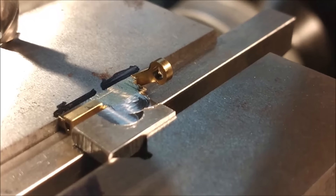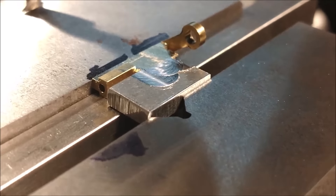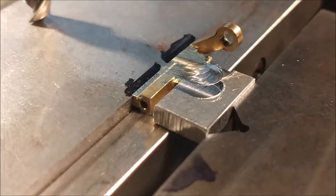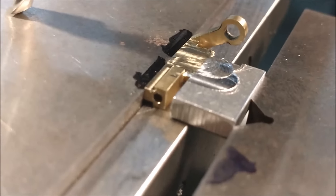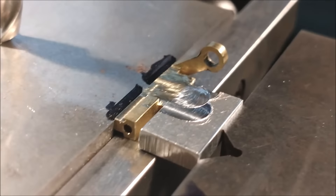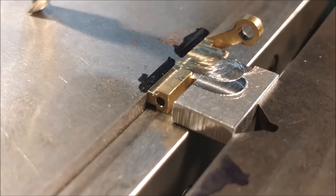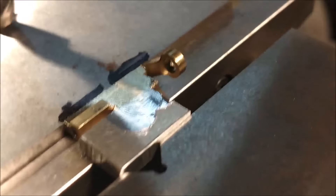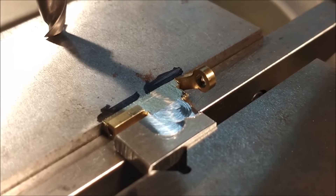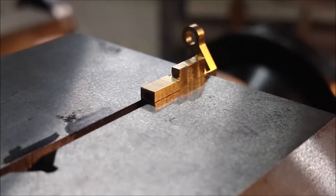You don't want too much surface contact if you're going to side mill — there's a very good chance it'll bounce away or suck into the cutter. The little sacrificial aluminum block served its purpose well. Now I can flip this thing over on the 0.075-wide back land and nibble away at the chunk that's currently holding it, and this part will be complete with the exception of a set screw on the top. It's a tiny little part — and it always looks bigger on camera.